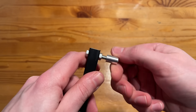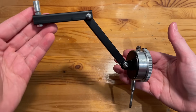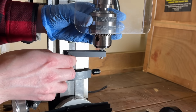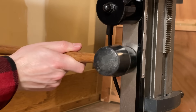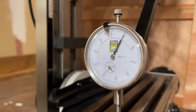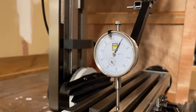Okay, so with that PSA over, and now that the mill isn't going to fall onto our lap mid-video, we can get started on dialing everything in. I threw together a simple alignment jig to hold my dial indicator and did a sweep to check the alignment. With a bit of precision hammering, I was pretty quickly able to adjust it to a less than one-thousandth of an inch drop across the bed. I'm pretty happy with this — we could probably spend more time dialing it in closer, but I'd want a tenth indicator for that, and this is good enough for me.